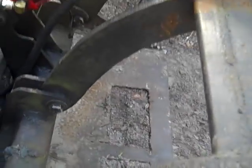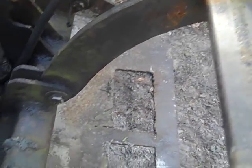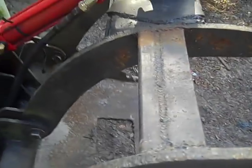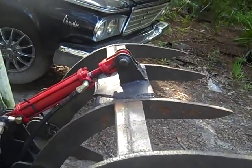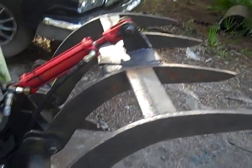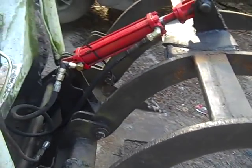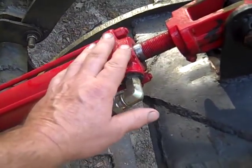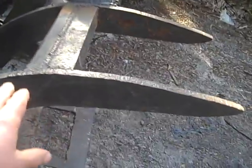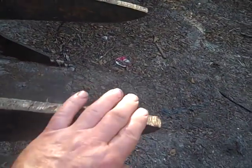This is another video of my Bobcat. What we have here are some grapples that I built. I saved a lot of money because these can go for anywhere from a thousand to three thousand dollars. I bought a cylinder from the hydraulic supply for about a hundred bucks, and then I cut these out of three-quarter inch steel.